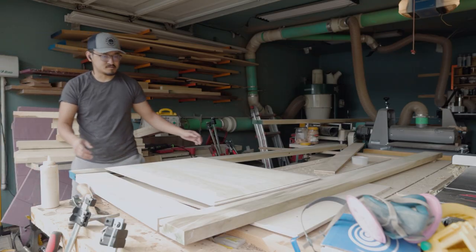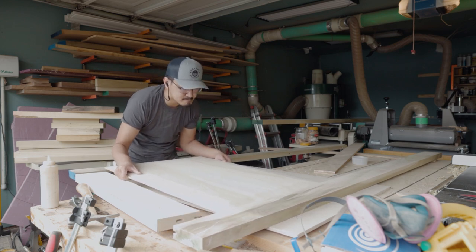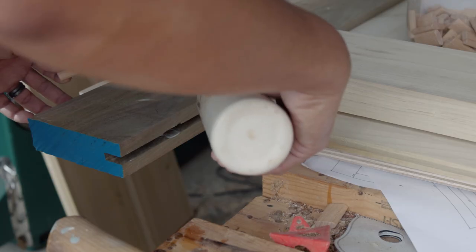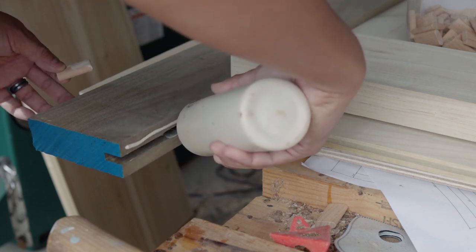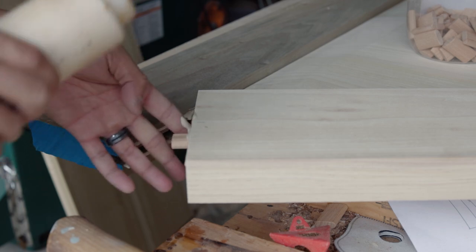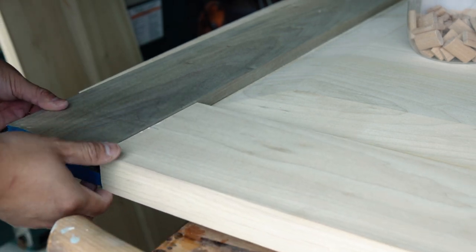Gluing two large doors was stressful, to say the least. I made sure that each connection point was filled with glue and checked for square as I went along to ensure that the rails were indeed straight. This was a big door and I didn't want to have to take it apart because it wasn't perfect, but I also didn't want the glue to set while I was making adjustments. This is where thinking through how I would clamp up the door ahead of time really helped — I had clamps that held parts together where needed, and also clamps that kept the rails and stiles flat in case I was a little bit off with my domino.